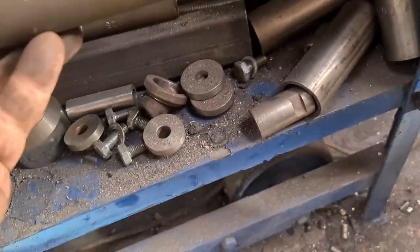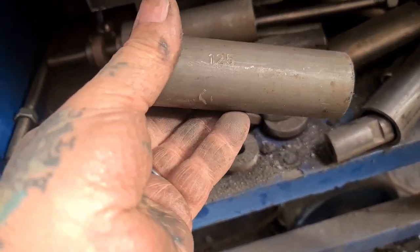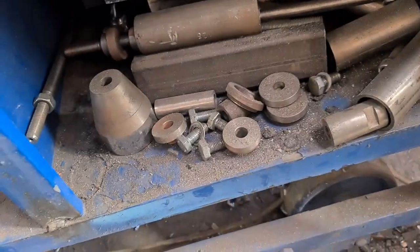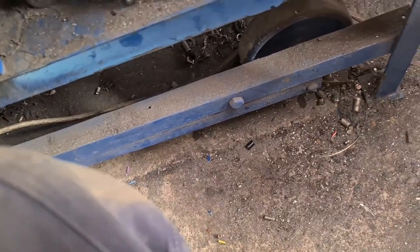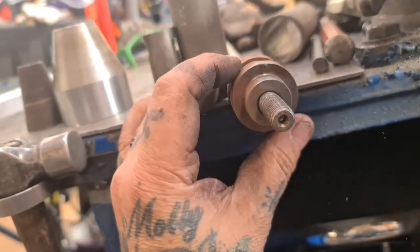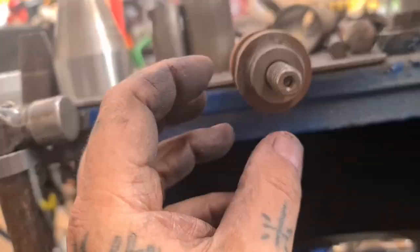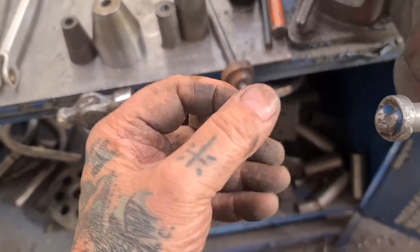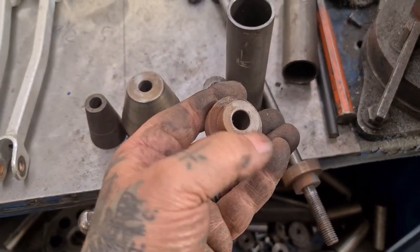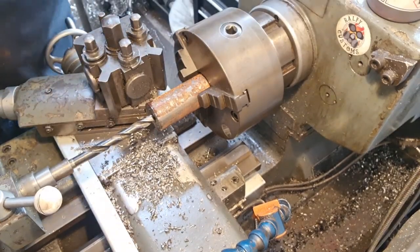the ends. Well, this is what I use to space machine-faced bits of tubing. That's 125mm long, obviously. But in between there and the spindle, in between there and the upright, we have these just locating the swing arm, is what I'm trying to say. So, whatever size they are, they're 25s on this bit. So that fits in the swing arm. But that looks at least 25, probably bigger, that spindle. So we are having to machine some of these.